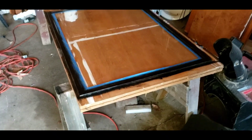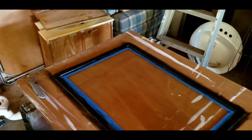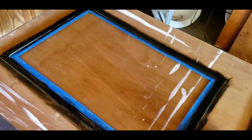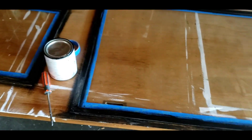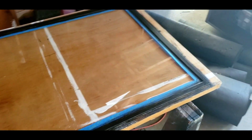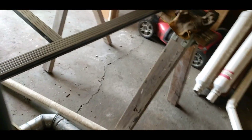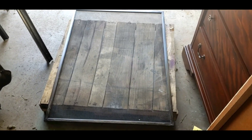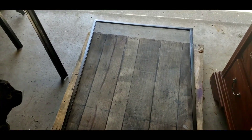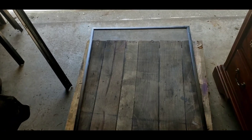I've got a jump start on my painting and I've taped off the windows. This satin Rust-Oleum brushes on really well. You could do it quicker with spray paint, but it's windy and hot and it feels like a waste. On the last door, no matter how many coats I put on, I kept seeing the spray pattern — it would not level out. After two cans I gave up and switched to a brush for the final coat. I even painted the screen, because that silver aluminum screen practically disappears with a coat of black, so I used a really dry brush and went in every direction on one side.